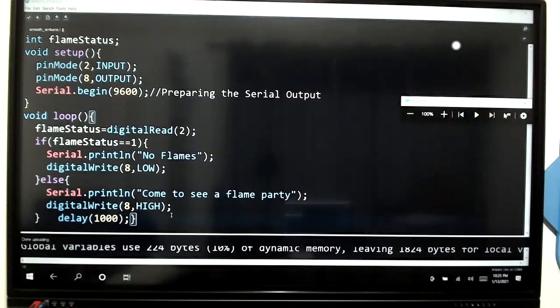I was explaining to the whole class, the LED is not lighting up. Make sure that your LED positive side is properly connected to pin number 8. Check whether it is the long side. Disconnect it and connect it and see. Try using another LED. Akna, do the same and see. LED positive wire should be connected to pin number 8. The positive side is the long one. Zainab finds it to be working now. You have to work on it to get the output. Positive wire goes to pin number 8, kids, come on. Check. And then the negative wire, the short pin of the LED, connect it to ground and see. Now check, Akna. Check now, Netmi.